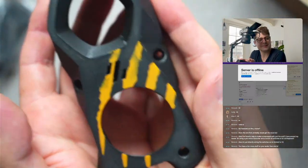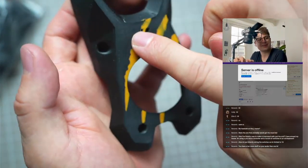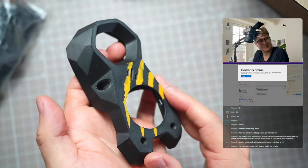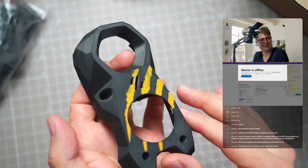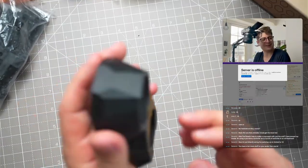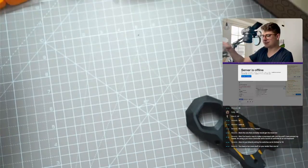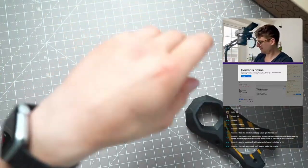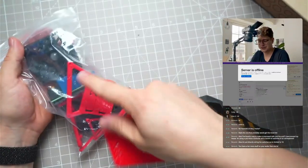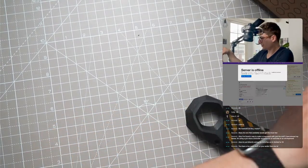And if you haven't seen on the thumbnail, this is our StealthBurner. I'm not 100% happy with it yet - there's a little bit of bleeding of the black into the yellow. The yellow parts are PLA of course, and it got completely gooey on the 100 degree Celsius bed. I did sand the front down to give it a bit of an interesting finish - it's a very smooth matte now. I'm not sure if we will keep this forever, but this is the first iteration and it was printed on the V0 before I had an input shaping setup, so we have a bit of ringing. At some point I was running out of ABS by about 100 grams, so I printed some of the electronics mounts in red ABS - but nobody will see that, so not concerned. These are all our parts - technically I guess we can get started.